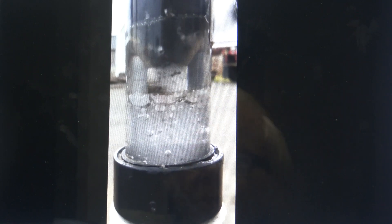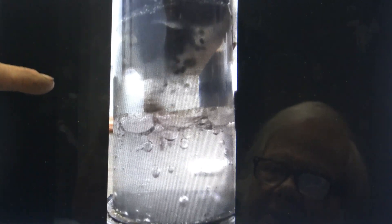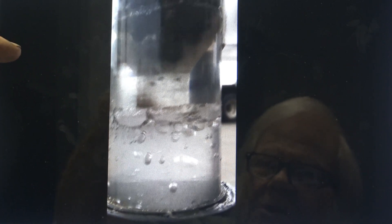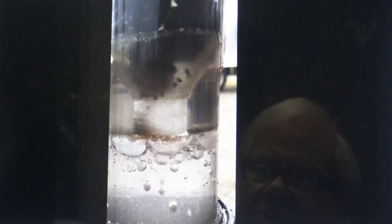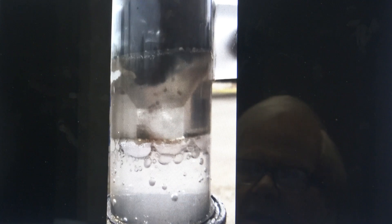As the material is being sucked from the barrel into the Gold Drop, you can see all the rocks spinning around and all the lighter stuff going up into the trap. The lead is at the bottom because it's so heavy — it's dropping out because the elutriation water is supporting the rocks in the trap and will not allow them to drop out. You can also see copper and brass floating around in the trap, even down at the funnel. A piece of copper just dropped out too. But the elutriation water is forcing the rocks, keeping them suspended up in the trap, while the lead, copper, and brass will drop out because their density is greater than the rocks.